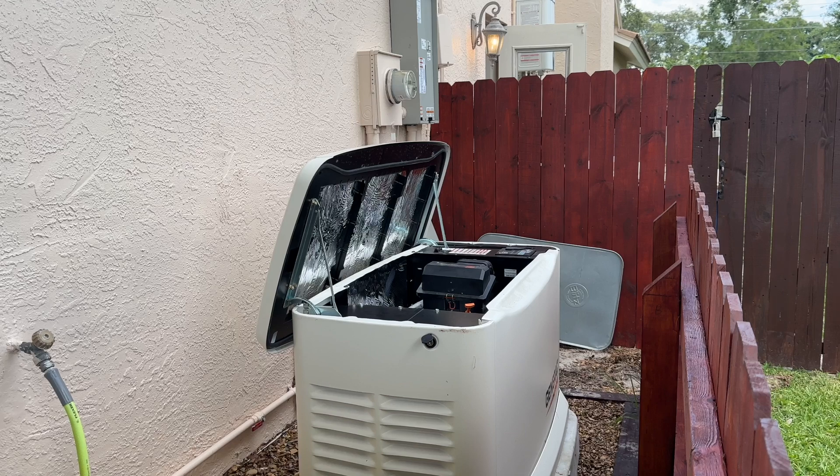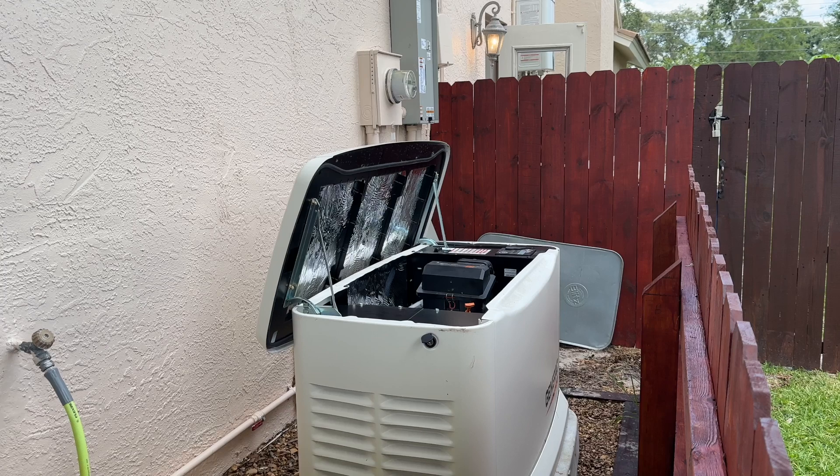Regardless, it's a good thing to run that gin head under load every now and again. I exercise my generator once a week, because engines are designed to run — and if you let it sit for a month, condensation builds up in that oil pan, and you get milky water and all that. They say it won't hurt it, but water creates rust. You don't want to see any milky oil in your generator. So run it at least once a week.